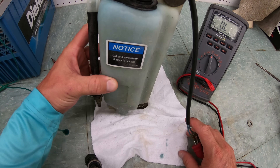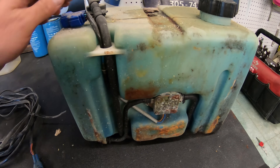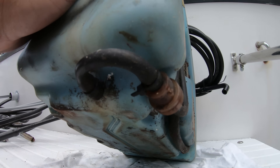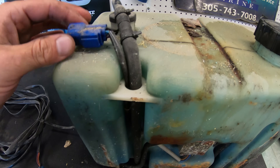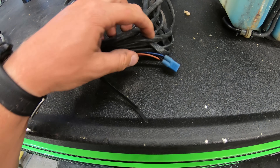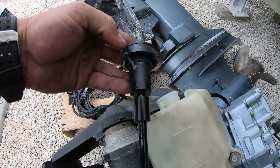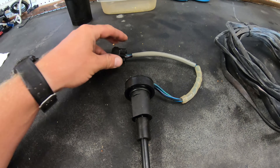Now for the Yamaha system it works great, it just has more components that factor in to make it work. We have a sensor inside of the reserve oil tank that sits inside of the boat — this sensor lets the computer know the level of the tank. Then we have an oil filter in line on the bottom of the tank, as well as the oil pump that sits inside of the back of the tank. There is a harness that runs from the plug operating the pump and the float sensor all the way up to the engine, where it hooks into the engine harness and goes through to plug into the computer, as well as the sensor that goes inside of the main oil tank on the engine.